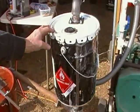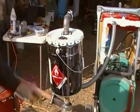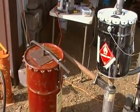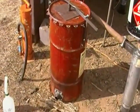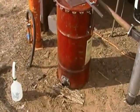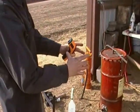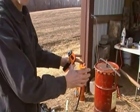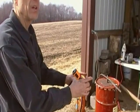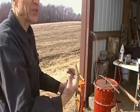It just needs a little bigger plate on the bottom so it doesn't wobble — it just has a little three and a half inch square on the bottom, and the metal on the bottom of the can is pretty thin. So George, where does that pipe go after it goes into the bottom of the drum? It goes into a piece of refractory that's about this big around. The dish in it is about the size of a yogurt container, and it has a round cast iron drain plate on the top with a bunch of little holes. I'll show you a picture later.